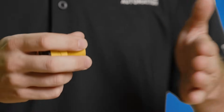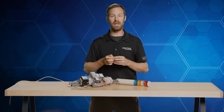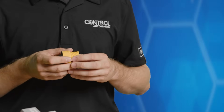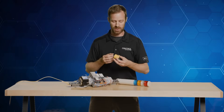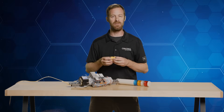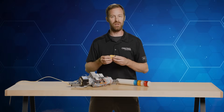Since this sensor is a combination of both analog and digital, we can set the threshold of the time it takes for that object to bounce the sound back to the sensor. But if we want information that tells us how far away an object is, the sensor simply measures the amount of time and returns the distance as a voltage or an analog value. For this particular sensor, the analog value is between 4 and 20 milliamps — a very common industry standard known as current output analog sensing.